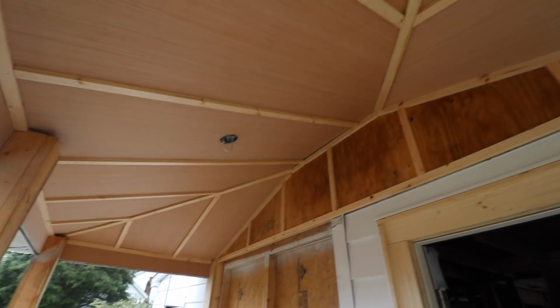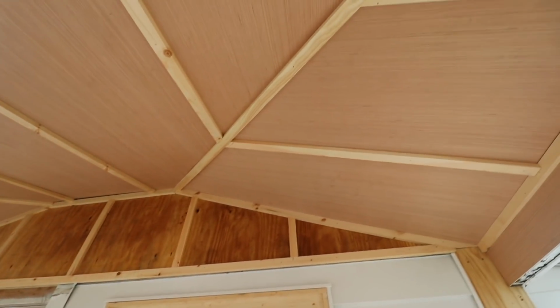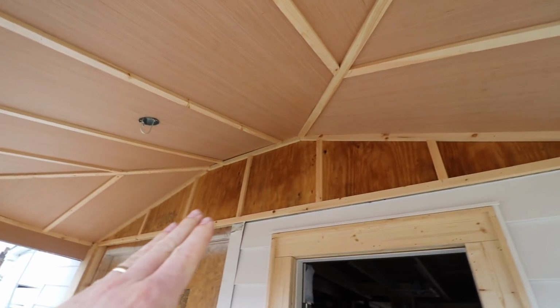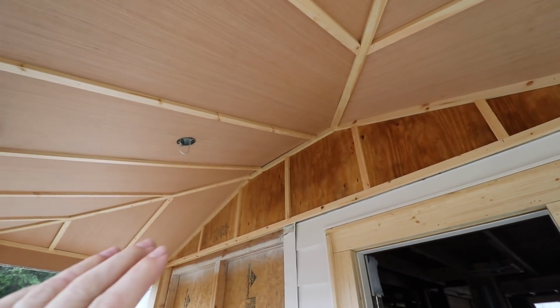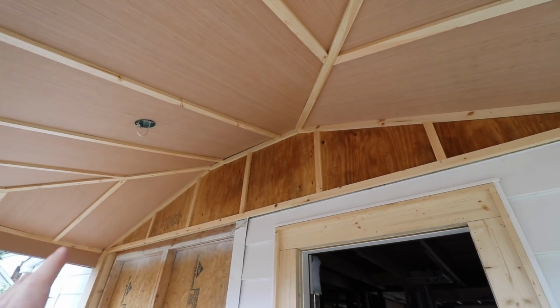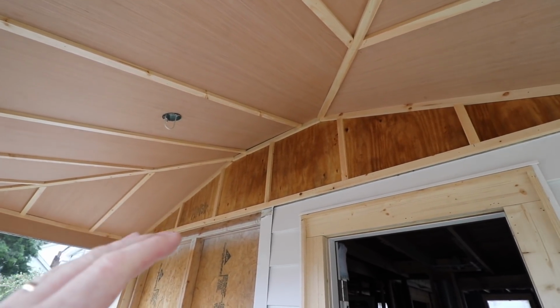So looking up into the ceiling, I'll say right off the bat, I'm not looking for perfect. I'm looking for good. And I am pleased. So we've got the 1/4-inch luan, and then that was 3/8 inch sheathing. So I picked out the best pieces I could. It's not really, I'd say, a paint grade wood, obviously. It's meant to go up and house wrap and then whatever kind of siding attached to it, but I just picked some nice pieces because lumber's so expensive right now.